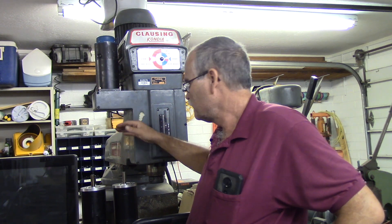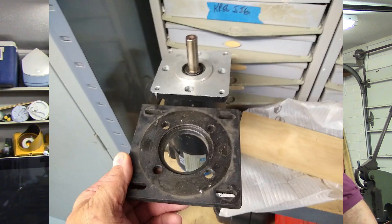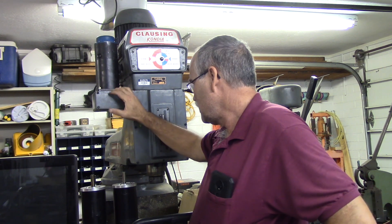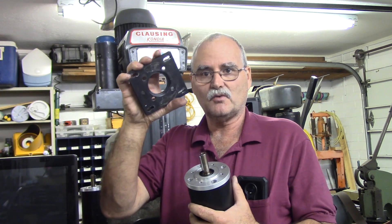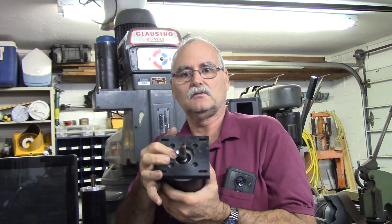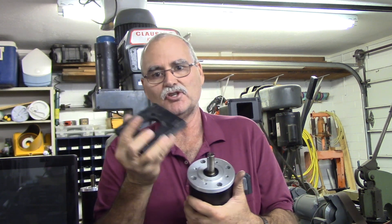And that the cover may not fit, I decided I don't want to go that route. So I had these Centroid servos — they were all square flange, but I need round flange for the X and Y. What I was able to do is drill and slot the top of this casting, which is machined, so I have adjustment here for the Z-axis servo belt. I took this plate — the one I showed you a minute ago that fit the original round body DC brush servos — and used it as a template.